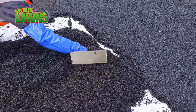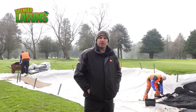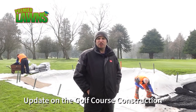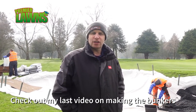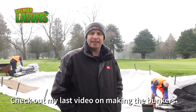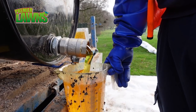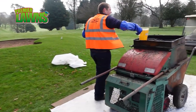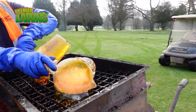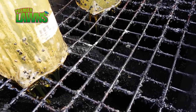So we're at the 10th bunker now, and this is the last stage before the sand goes in. This is the rubber crumb liner going in with CRL - really just crushed tires and resin bond going into it. Then we'll be able to come in behind them with the sand. What the rubber crumb does is stop the material underneath getting into your sand, which contaminates it and makes it less white. It also stops the sand going down and blocking your drains. It has a number of benefits - it's quite costly, but we're going to be the first club in Northern Ireland to have all 18 holes with a liner in them.